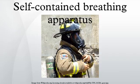The other major application is for industrial users of various types. Historically, mining was an important area, and in Europe this is still reflected by limitations on use of metals that can cause sparks in the construction of SCBAs. Other important uses are petrochemical, chemical, and nuclear industries. The design emphasis for industrial users depends on the precise application, from cost-critical at the bottom end to the most severe environments where the SCBA is part of an integrated protective system including gas-tight suits and ease of decontamination. Industrial users will often be supplied with air via an airline, and only carry compressed air for escape or decontamination purposes.